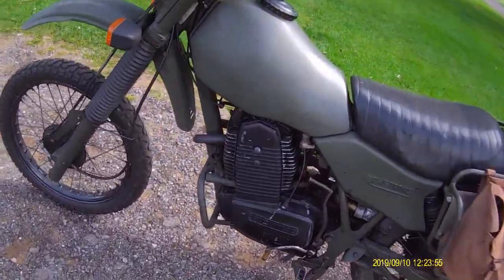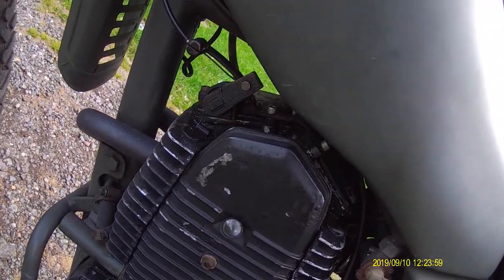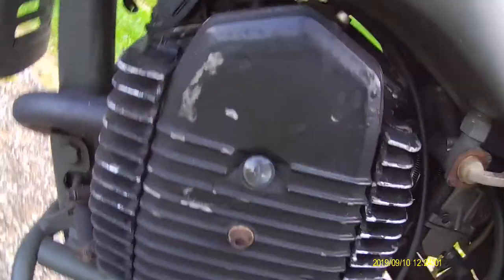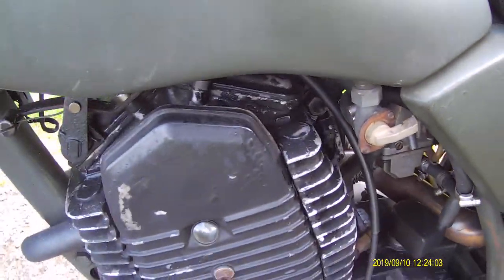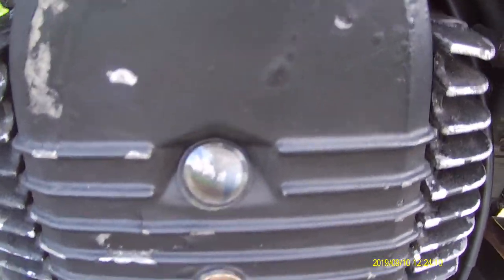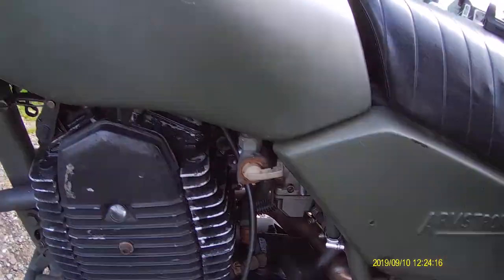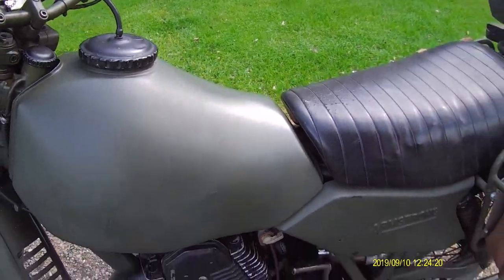One of the things you've got to remember is this eyesight here. As you turn the thing over, you will see, possibly, if it's lucky, the decompressor. Come on. There, a little white flash that came through. That's top dead centre. You get it to that, and you give it a damn good hit. And that usually gets it going, as you saw.